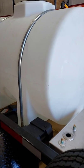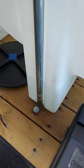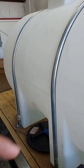The first thing that we do whenever we build a trailer is install the tank. Whenever you have a tank, we recommend spending the extra and getting what they call bolt down hoops or straps. Some tanks don't have an application where this is possible, so you'll have to fabricate your own straps and either put d-rings on the bottom or hooks so that you can make some straps and have the tank strapped down.